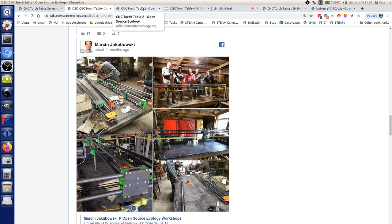The next step after this would be oxy-hydrogen, which is a cleaner, faster, more sustainable cut because you can generate oxy-hydrogen from splitting water. That would be part of an off-grid microfactory — you generate your oxygen and hydrogen on demand from water using electricity. Interestingly, if you look at the history of oxy-fuel cutting, it started with hydrogen, because hydrogen was easy to get by splitting water. Acetylene came later, requiring a chemical process.